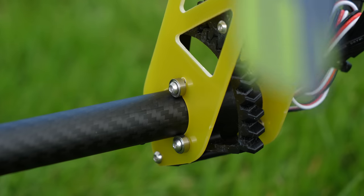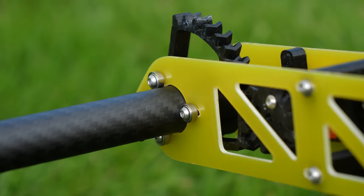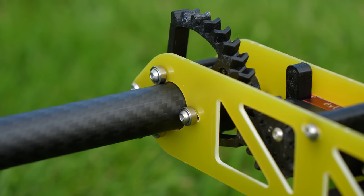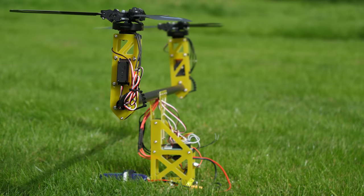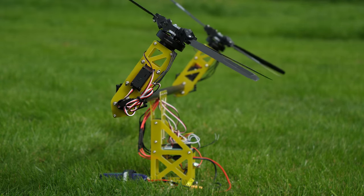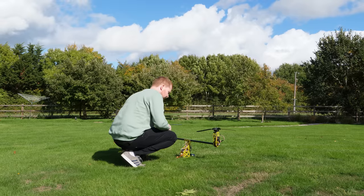To remove the play in the hinge I've chosen to use three small bearings, which can be tensioned to fit the shaft. This is not only lighter than a single larger bearing, but also these shafts aren't precision machined, so finding a large bearing to fit was near impossible. There is still some flex in this portion of the frame, but it's exaggerated a lot when on the ground as the motors bounce back and forth, so I might reinforce it at a later date. But for now, it's time for another test flight.